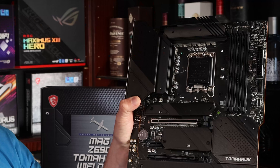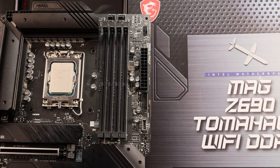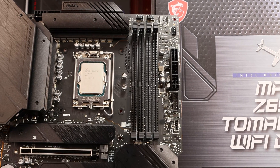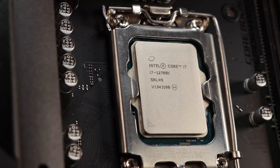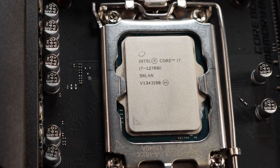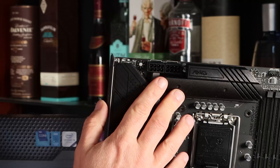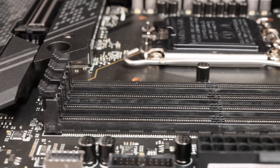Taking a quick look around this motherboard, we can see that it's got a 16-phase VRM — a great deal of power delivery to get clean power to the CPU and assist in system stability and overclocking. That's overkill for any CPU you can fit on this board, and that's similar for any Z690 motherboard across the range. There are two 8-pin CPU power sockets, although you do only need one CPU power plug to fully power this board.